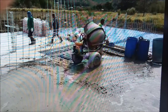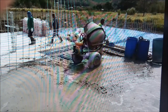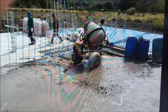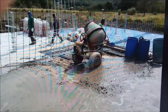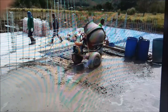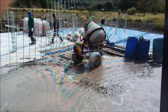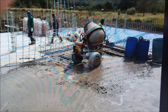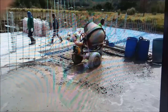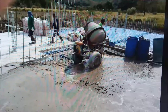You can roll a 6-inch pipe across it, or I also had a power screed with two boat-trailer winches on the end and an out-of-balance shaft in the middle that shook the thing and turned in the direction that hopped it forward — pushing the concrete ahead and leaving it really flat. It was made out of aluminum truss; the middle piece was store-bought and I made the outside pieces. First job I took it to, it was eight feet too short, so I spent the morning making it 12 feet wider. It worked just fine. For 12 or 15 years it sat outside wherever we left it, and nobody ever stole it or even stole the motor off it — it would start right up anytime we wanted.